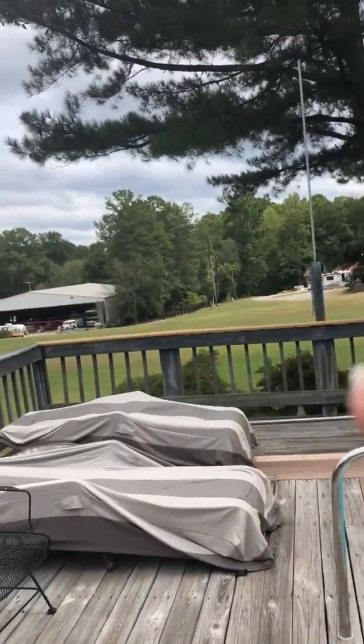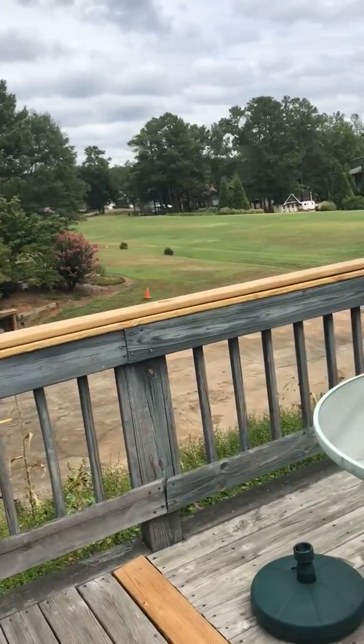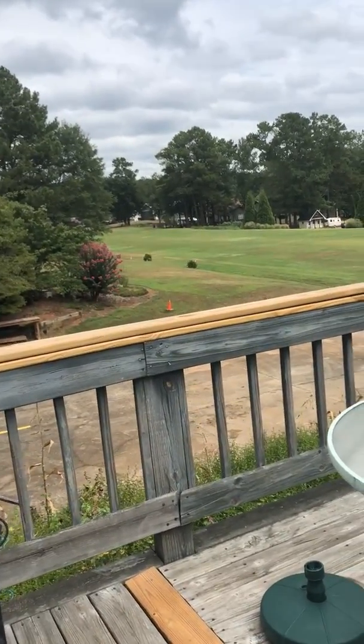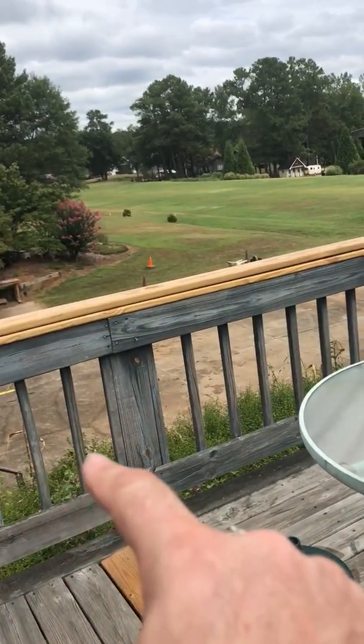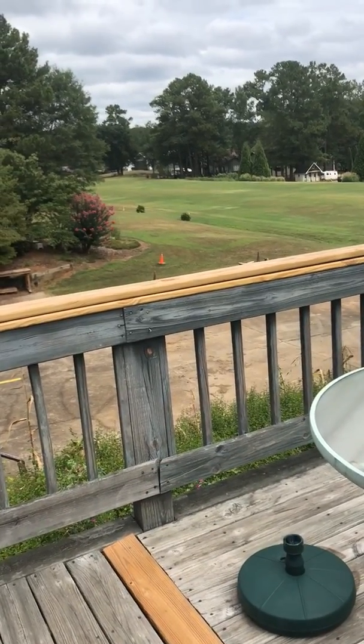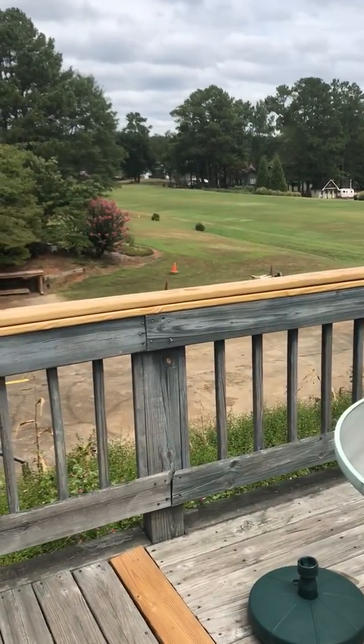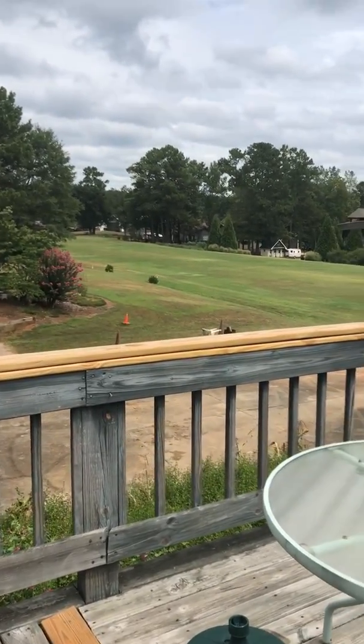It's really a beautiful deck. As we come down across, we'll replace the top railing all the way through here. The balusters are all in great shape — they don't meet code, but he's not selling the house. If he did, they'd need to be four inches on center; his are about six, seven, some as much as eight inches off center. You could install every other one, or put a lattice across, but then you'd give up this view — he's just got a great spot over here.